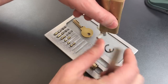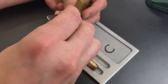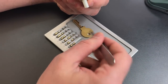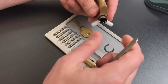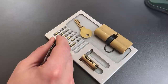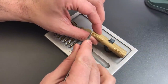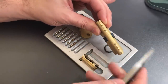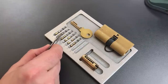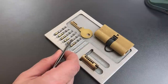I just dropped a bunch of pins. Two spools in the back, so no way of confusing them. Let's get the rest of the springs out — I'm pretty sure they're all the same. Looks like we have all standard key pins. We have a steel anti-drill pin in slot one, and also a steel pin that goes right down the front of the pin stack on the Bible for drill resistance. Standard pin in slot two, which is a zero-lift pin — so I'm not even sure you need a driver pin in there technically, but good that they put one there. Standard pin in slot four, and the other three driver pins are spools.